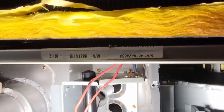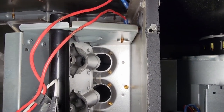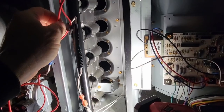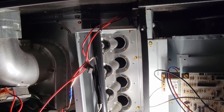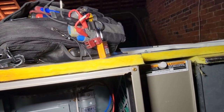You can see the wires have gotten pretty warm. That crimp on the rollout switch there has gotten a little warm. Carrier has a tendency to run their burners really hot on the corners — I wonder if it's under-firing possibly, the burners just seem really low. What I'm going to do is get that wire moved away from here so it can be held out and away from the burners, instead of the radiant heat going right up to it. They do have an insulated piece on top here that's probably trapping more heat in.